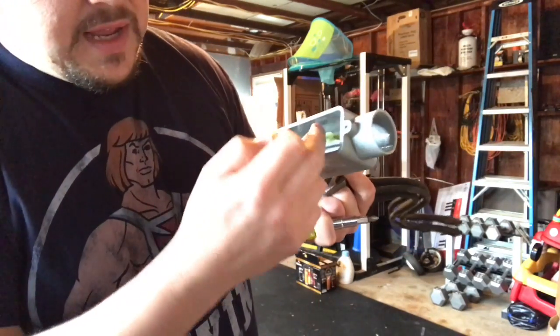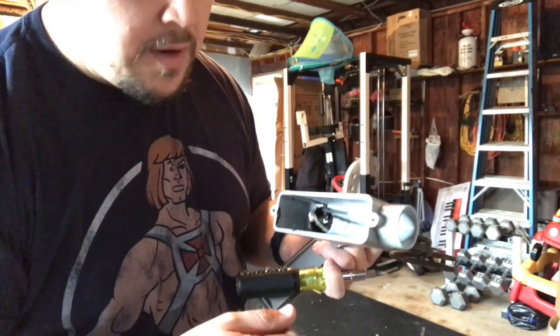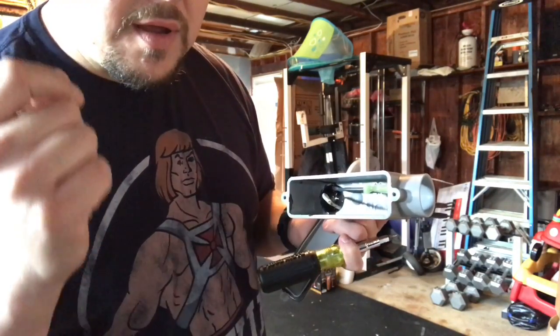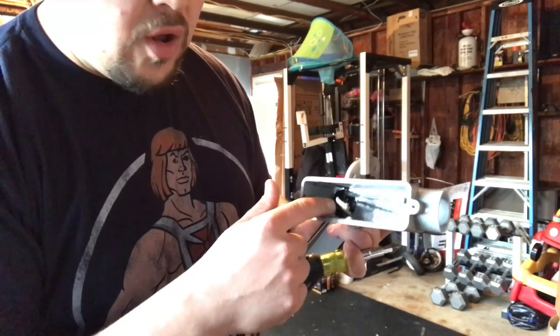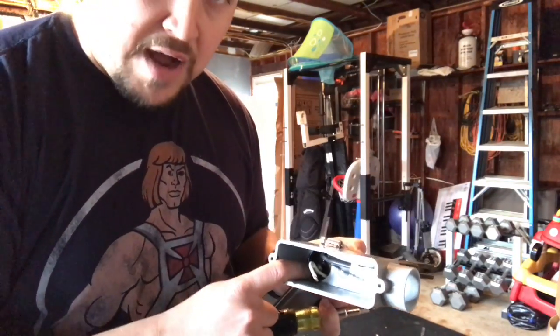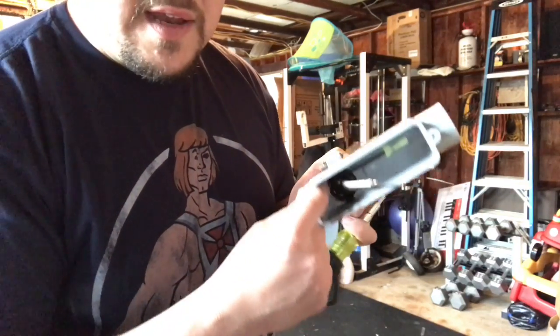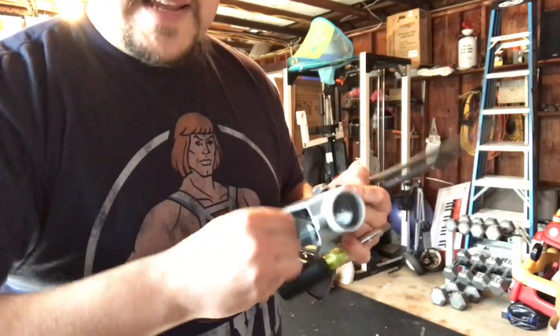What should have happened is you twist together the solid core wiring, you put a wire nut on, or you would have a complete connection solid from your output on your PID and your solid state relay all the way to your boil kettle element, and you would fasten it securely and ground it properly. The way mine was grounded, they just wrapped it around the boil kettle and then JB welded around it to hold it there. They didn't even put a nut and bolt. So with this being said, this can cause your whole house to catch on fire.